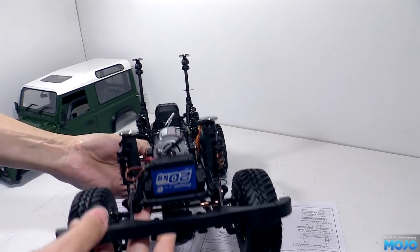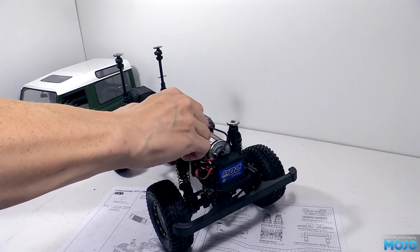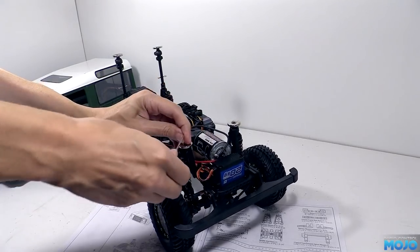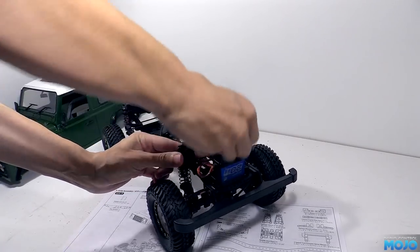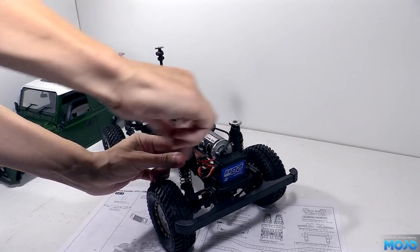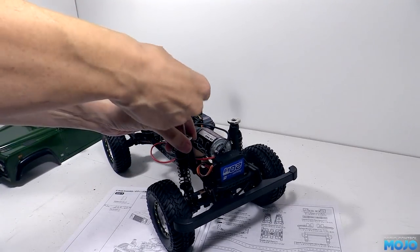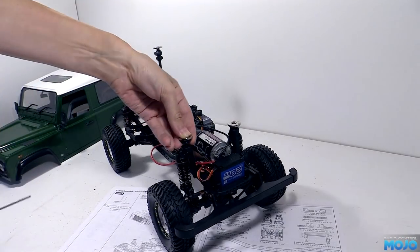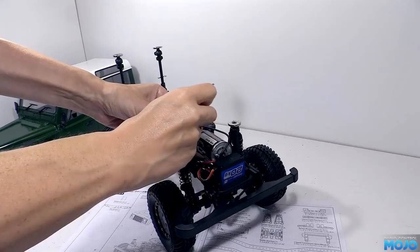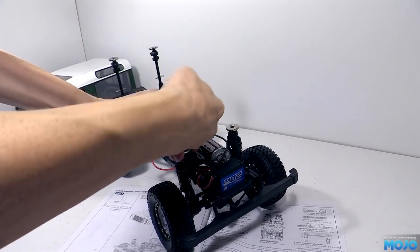The rears were a little bit different — rather than putting the spacers under the magnets I fitted them under the posts. That means rather than needing a long countersunk screw they need a longer grub screw, so I just cut some M3 studding to length as I had some handy. The spacers I ended up with are quite a bit bigger than the front ones — not intentionally though. I screwed up the cut to shorten the post length so made up the difference in the spacers. It's amazing how often that 3D printer saves me from myself.